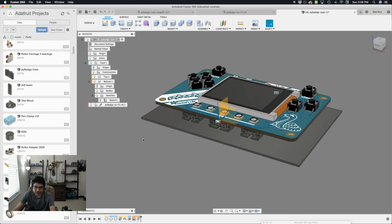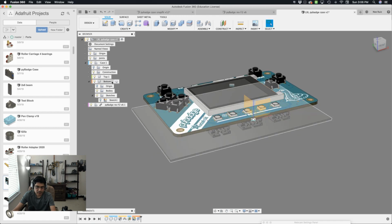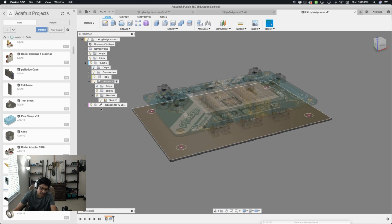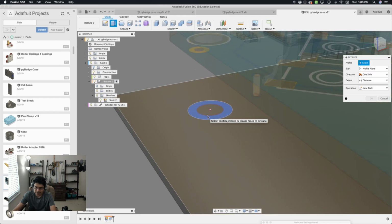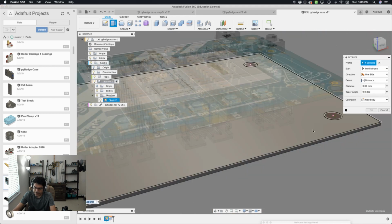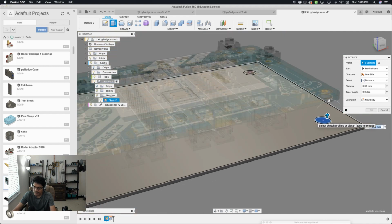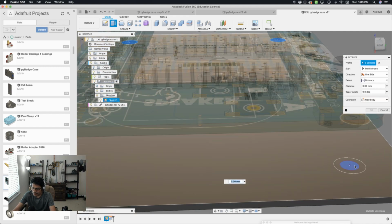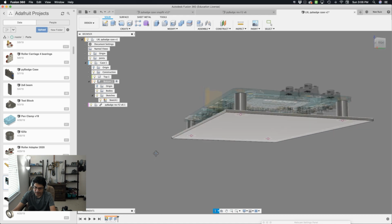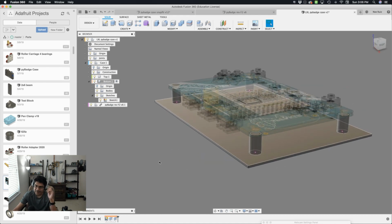Excellent. So with that, now I want to create another extrusion. Again, I want to make sure I'm in the right spot. Bottom, activate component. Let's turn on that sketch. I'm going to bring up the extrude tool, the letter E, and just click these circles here. So it's going to be these 8 circles, the inner one and the offset. So that gives us 8 profiles to select. Almost there. This one and this one. Cool. Now that we have that, we can basically just type in the distance, bottomDistance, because that's basically the same, right? So hit OK, and that gives us that. So now that'll update whenever we change the bottom distance if we need to. Like I said, bigger battery, bigger speaker, that might be it.